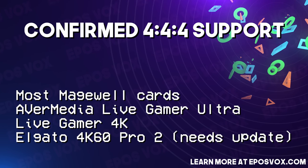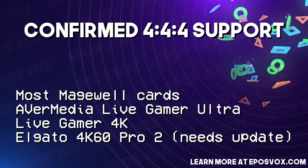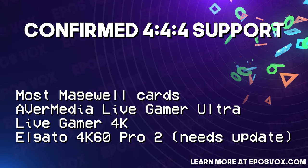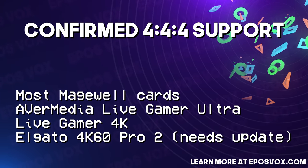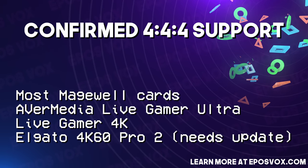For sprite-based and lower resolution games when you're scaling them up, NV12's color compression will cause ringing in your text and colors that aren't scaled correctly because that information is gone. You want to bring in the highest quality signal available. I'll have a list on screen and in the video description of capture cards that support 444 RGB. If that's available to you, YUY2 or 444 will improve your results; otherwise stick with NV12. Avoid MJPEG and H.264-based capture cards at all costs. Results from a $20 generic capture card will be much worse than the 444 output of the Magewell, Live Gamer Ultra, or Live Gamer 4K, and even still worse than the NV12 output of an Elgato capture card.